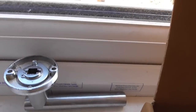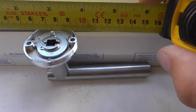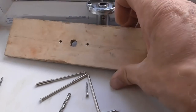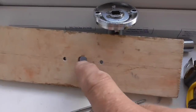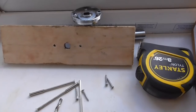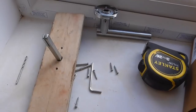What I tend to find generally — and I'm going to try and do this one-handed and film it — these holes tend to be 40mm apart, so they're 20mm either side of the spindle. So basically they're 40mm centres. What I've done is got myself a piece of 8mm or 9mm ply, drilled a hole through the centre where the spindle goes, and marked 20mm each side. I've also mounted some rubber on the other side of it.